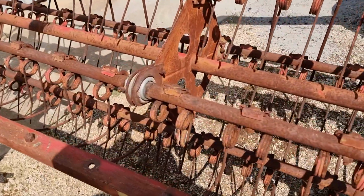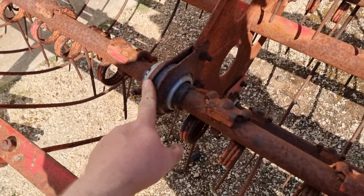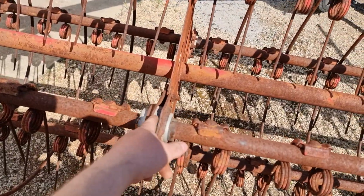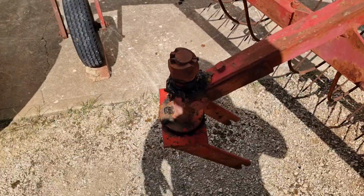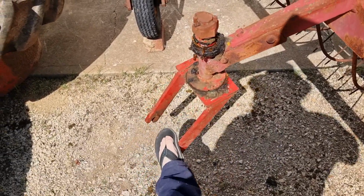And the fact that these bearings that are not turning in the housing have got that much wear in them, and you only get grease up one side, so I think the best thing to do would be put a grease needle in there and feed them with grease that way. So I've got the other caster wheel off because I've got to get a new tube for it, which I got ordered.